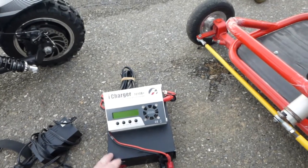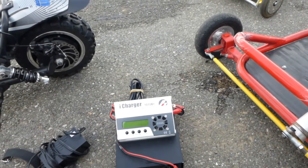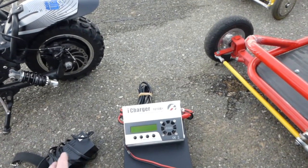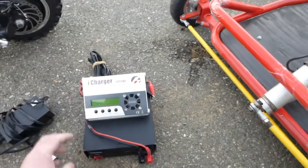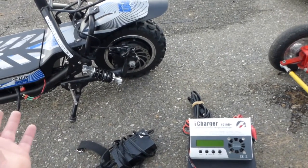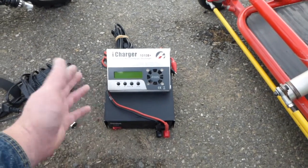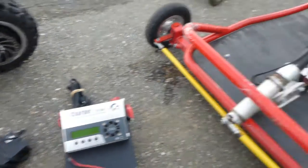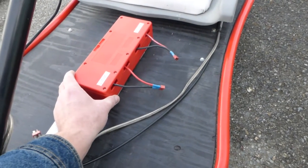I'm using an iCharger 1010B+. In my opinion it's the best charger for my application. I did try a Duratrax one, then a Thunder Power — model 1420 I believe, up to 14 cells — I didn't like it. This one I mounted permanently on a power supply: a RadioShack 19-amp 12-volt power supply. It works really good. The scooter battery is 36 volt 20 amp; it can charge up to 7.5 amps per hour. With a more powerful power supply it would kick up to 10 amps, but 7.5 is plenty. I use that charger for all my big toys — like my go-kart and my daughter's go-kart — with different batteries. This one is 24 volts, 8.8 amp.